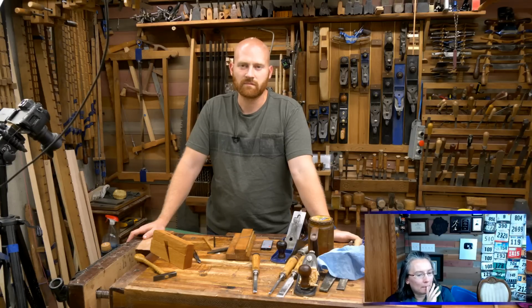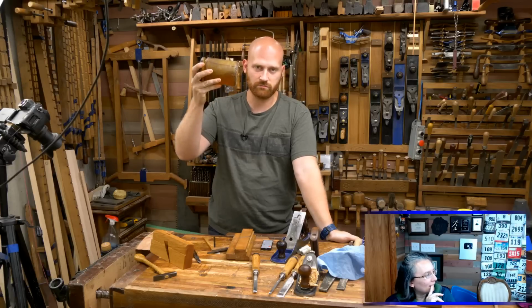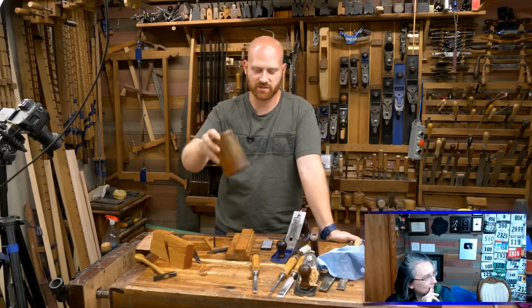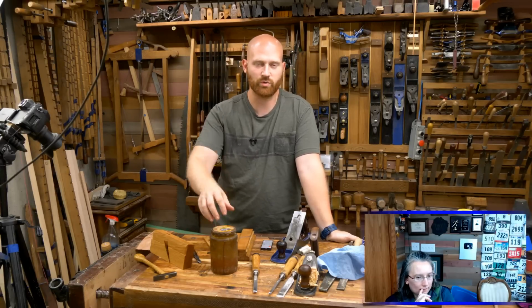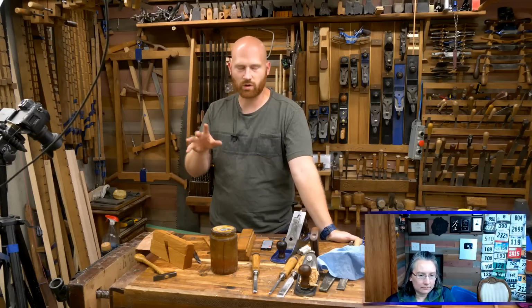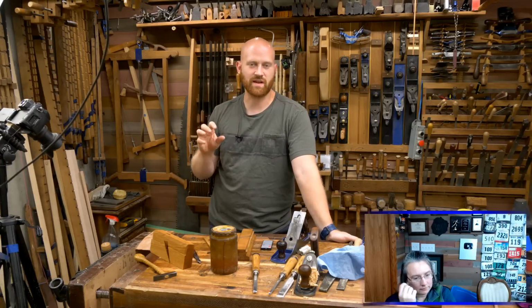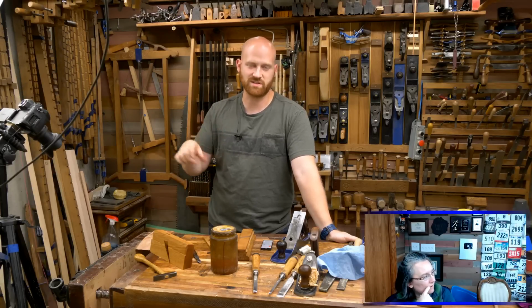So, yeah, the homemade stuff, I mean, literally, you could drink this stuff. It's just linseed oil. It's raw linseed oil that has been raised to the temperature of polymerization, and so it will polymerize much quicker. The way the store-bought stuff is made is they boil it, but at a much safer temperature, and then they add in chemical dryers so that it will speed the polymerization that way.